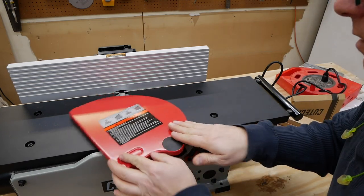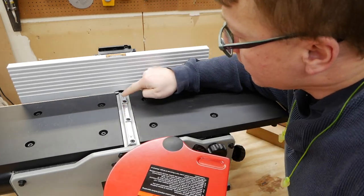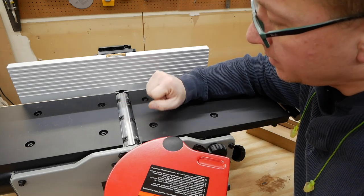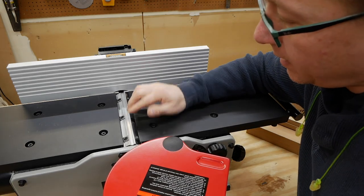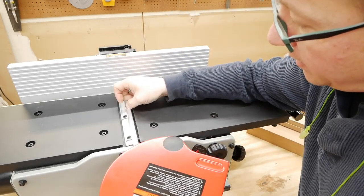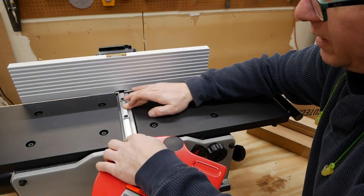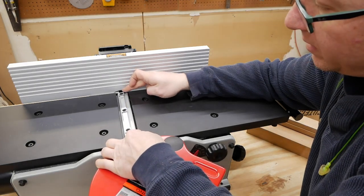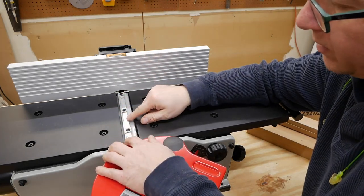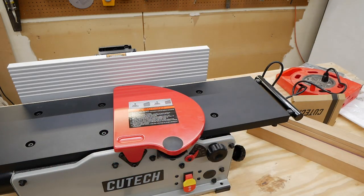Here is the cutter head on the 8-inch. You can see there are three cutter heads on each side, and if I rotate it you can see how they're offset — this creates the offset cutting mechanism. It's not a helical blade, which would be at an angle. It is a spiral cut bit, so it only cuts on these edges, which creates a much finer cut. Three per side. It says there are 15 knives on the 8-inch. We're going to throw some boards on it and see what happens.